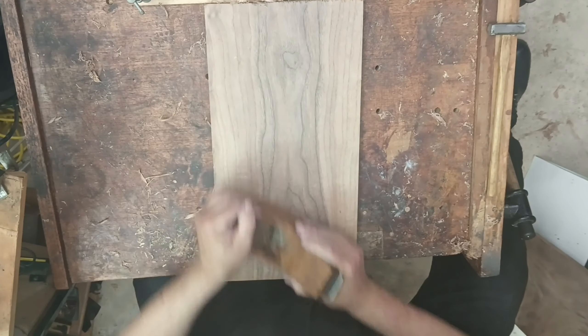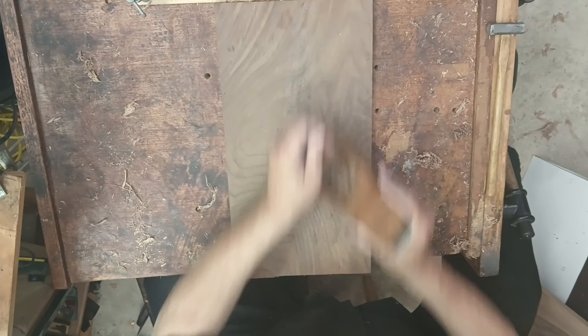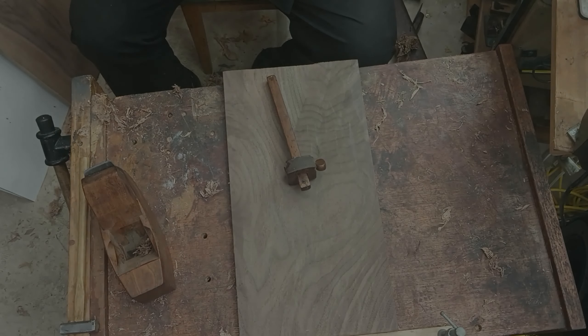The first step is to give them some smoothing. These are actually milled boards, and I smoothed them on both sides with a smoothing plane that has a very even cut, a very small mouth to the blade. Then I want to mark the thickness.